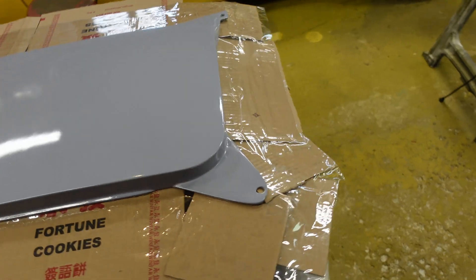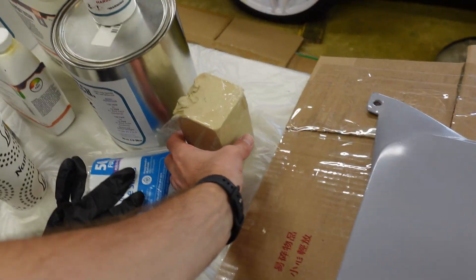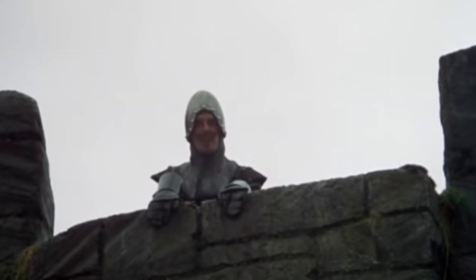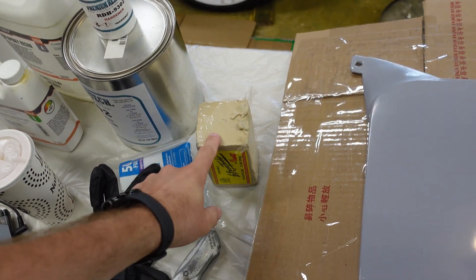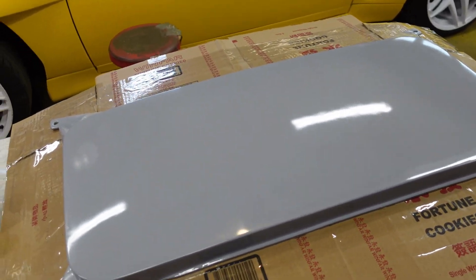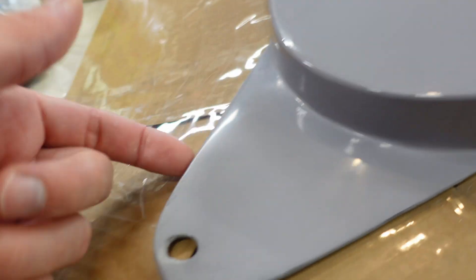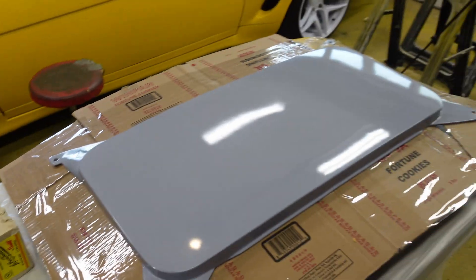It is the next day. Last night I finished taping off the entire mold flange and today I'm going to be using this clay. Nothing sticks to it and it's easy to work with when it's warm — I had it sitting on top of my printer which has been printing all night. What I'm going to use it for is filling in these little gaps, because we don't want the gel coat going inside the gaps. We're going to make a nice little flange, same thing with the hole — mostly fill it in and then it's on to the gel coat. Let's get started.